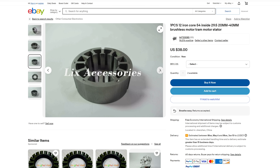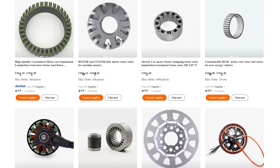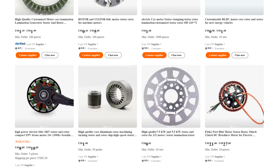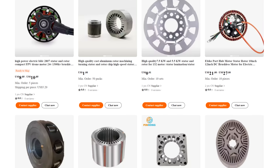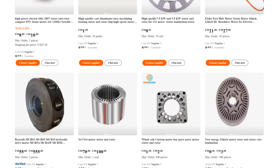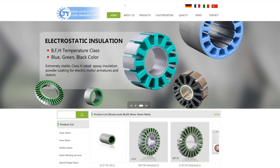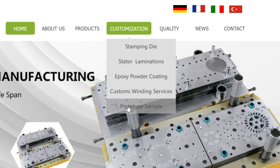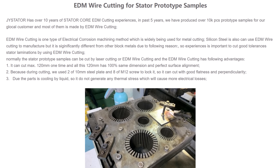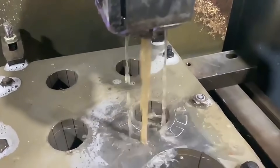So I ended up searching the internet hoping to find a stator core with similar dimensions to what I required, but ended up being unsuccessful. During my search, I ended up on Alibaba and noticed many suppliers offering custom stamped motor laminations. The problem was, to create a custom stator core, these suppliers must manufacture a die for their stamping machines, which is why they often have a minimum order of hundreds or even thousands of pieces. Just as I came close to giving up, I came across a company called JY Stator who offers a prototyping service utilizing wire EDM cutting to create stator prototype samples quickly and at a low cost.